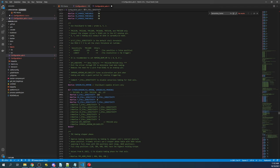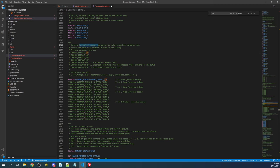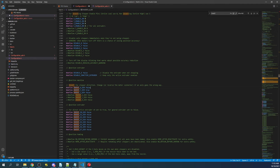Since I'm using 24 volts for my power supply, I'll search on 12 volts to find the configuration you may need to set if you're using spread cycle chopper. If you want to change this, go to the chopper setting and change it to 24, which allows you to use that functionality. I'm starting with the base configuration here. Also note the invert setting for your actual axis — sometimes it won't home in the direction you like, and you can change it by changing false to true.